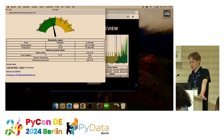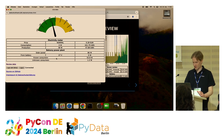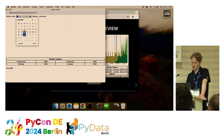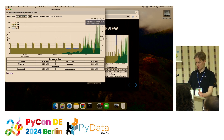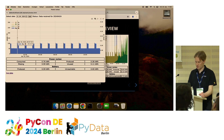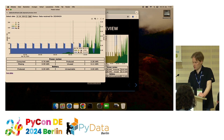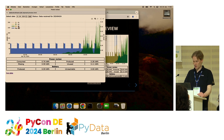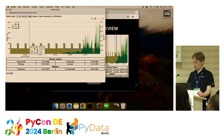I'm trying to calculate unknown consumers from the difference — but the sun just disappeared and that modified the calculation. I'm comparing the readout of the electricity meter with my measurements; they have a different timescale. Now let's look at the data from this day: this was my consumption — the peaks you see are my fridge. From the sun today it wasn't so much but it partly covers my consumption. Yesterday it was a bit more sunny, the battery was full, and I nearly covered the whole night from the battery.